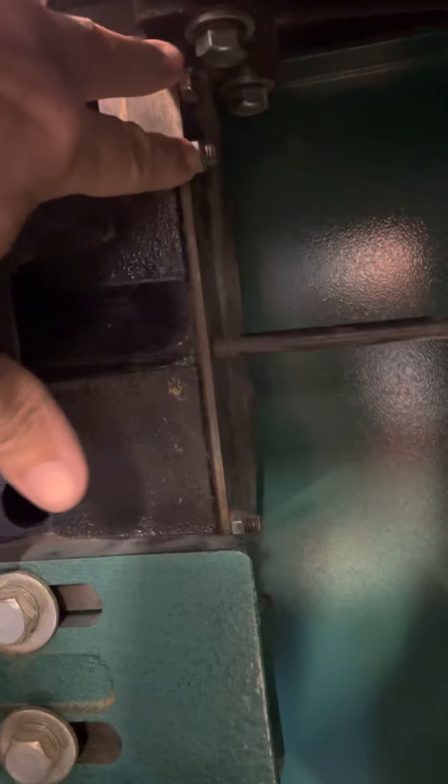What you do is loosen these lock nuts — these are 12 millimeter lock nuts — and these are 4 millimeter Allen screws. Put your 4 millimeter Allen screw in there, hold the gib adjustment screw, and back off these lock nuts so you can run them in and out without the nut jamming. Then run these screws in until they hit — you'll feel resistance. You don't want to over-tighten these. Run down until it hits and is snug, finger tight. Once it's finger tight, back the Allen head out one tenth of a turn and tighten this lock adjusting nut. Hold the Allen wrench while you do it — if you don't, that position will change and it'll affect the whole setup.